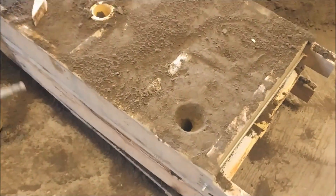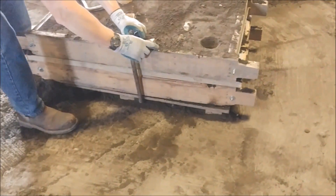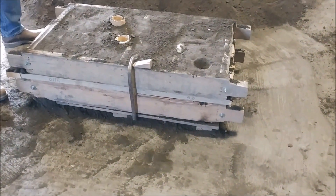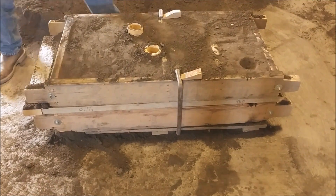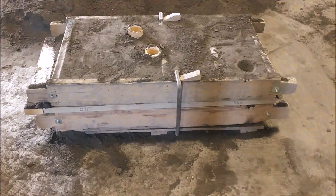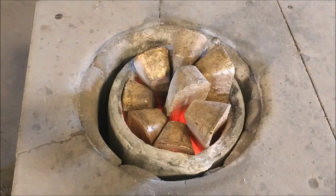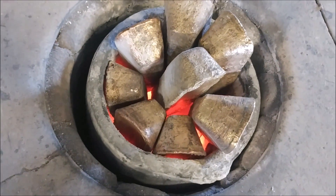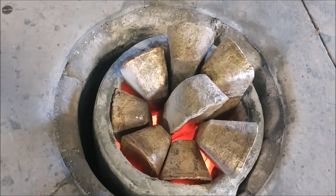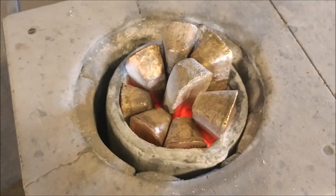Here's the finished mold. We're going to pour our metal in there — there are our two risers. We have the pattern in there still. We're going to move it over under the crane so we can pour it with the crane. We'll take the pattern out there because when you move it you want to keep that shape, and patterns are a good way to do that. Here's our crucible down in our induction furnace — this is a number 80 crucible and we've got it full of ingot. You can see it's starting to heat up. We'll come back when it's molten.